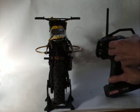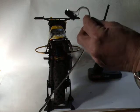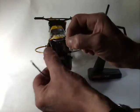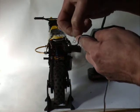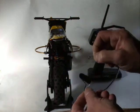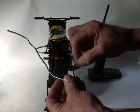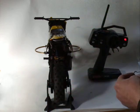The lights are down inside of the plastic tubing, so that should be pretty sturdy. The switch I ended up making for it is a piece of plastic with two thin pieces of metal on each side stuck down and wires soldered to them. And I took a spring and cut one end off of it, took the other end and bent it up in a loop so that it screws into the bottom of the servo. That puts the spring sideways this way so the rounded end rubs on the switch. So basically it sits in the middle in a neutral area and doesn't light anything, and as the servo moves left and right it slides that rounded portion back and forth over the contacts and switches on one set or one flasher or the other, and it seems to work just fine.